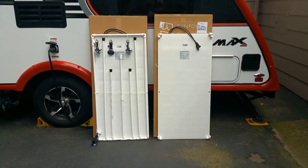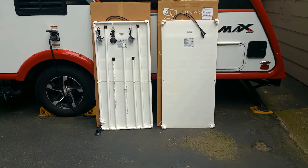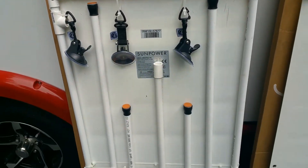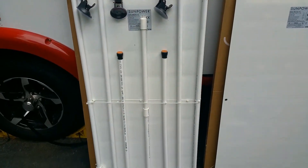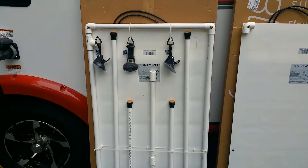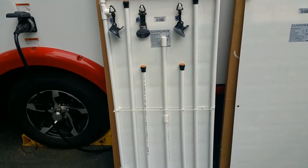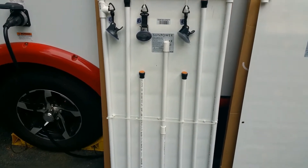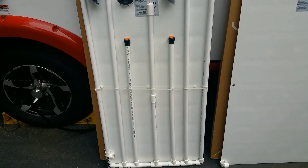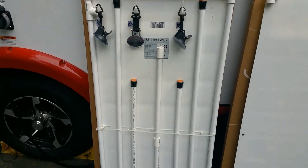Here we have the back side of the two solar panels — the one on the left is the completed frame and the one on the right is set up to build. You have extra lengths of PVC to adjust the solar panel angle. This one is set up lengthwise — the two outside pieces are almost the total length, the next set is about two-thirds, and the two in the center are about one-third. With the expansion joints you can do different angles — the longest ones are for a 45-degree angle, and the other ones give a lower slope. You can add on the other pieces and bring it up almost flat.